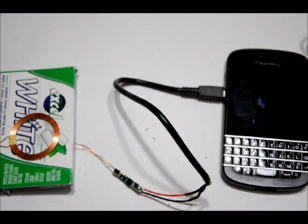Right now I'm pulling across only about 200 milliamps. If I had the transmitter and receiver a lot closer, it would pull a lot more than that, and it would charge a lot faster. This is the first time I've ever done this, so I'm just tinkering with it and having a little fun — because obviously wireless charging phones is not a new thing; it's just something I'm doing here to see if I can do it. You can charge a lot faster depending on the distance between the transmitter and the receiver coil.